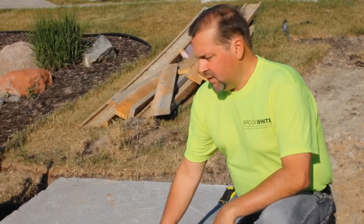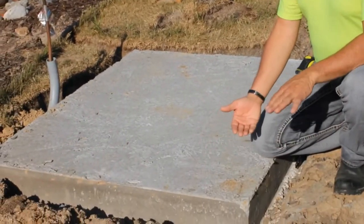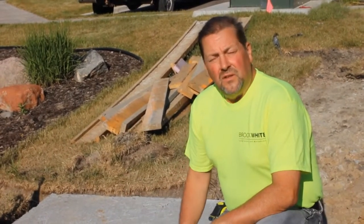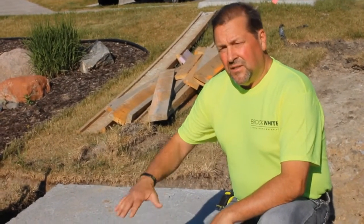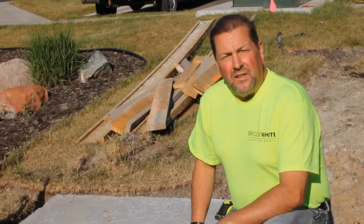We're at the fireplace pad. This footing has been poured, as I said, which will be 4 inches below the concrete pad. This will allow, if any ground movement, it doesn't affect the veneer on the fireplace, so the stone won't crack. We'll be building this up 18 inches to give it a raised hearth, and then we'll put the component kit, fireplace kit, on top of that.